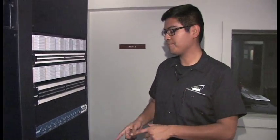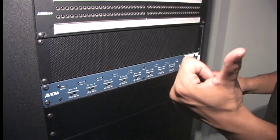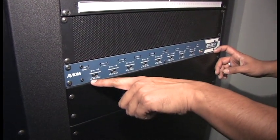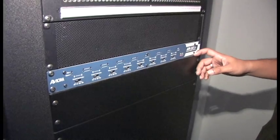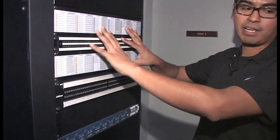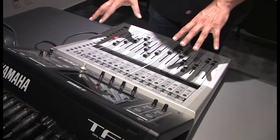Back in the control room, we have the corresponding receive unit for the ABM. It says 'output' here, and if we're getting a signal from Studio B, we should see the signal light turn on for whatever channel we're plugging into in Studio B. We want to make sure that this is set to mic level — we want to send mic level over to the mixer. The general signal flow is from Studio B to the control room, then to the patch bay, then over to the mixer where we can do all our individual mixing for each anchor. Then this audio gets sent over to the recorder so it all gets recorded at once.